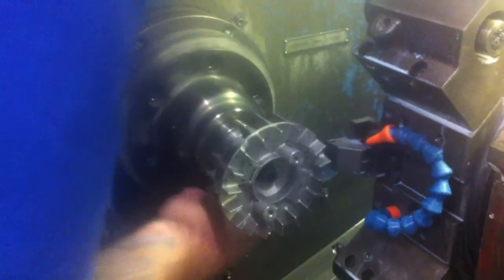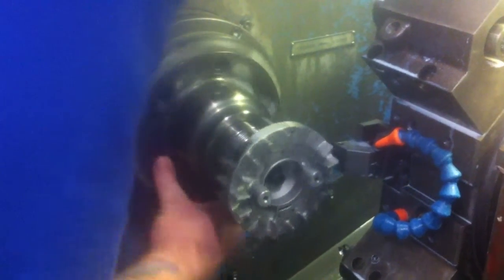There should be no gap at all. There's a slight bit of gap — I'm not sure what the runout is. So what I did on your last one: I took a sharpie to this side, then took a sharpie on the other side where the magnet is, and I just turned it until it cleaned up. These seem to be fairly decent, but that's what I do — on the other ones I took about 15 thou off or so.